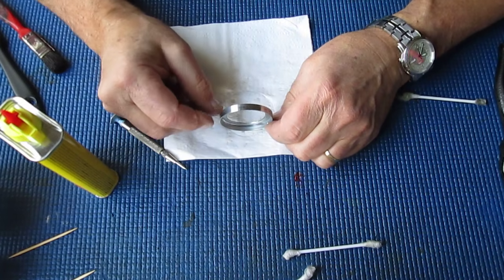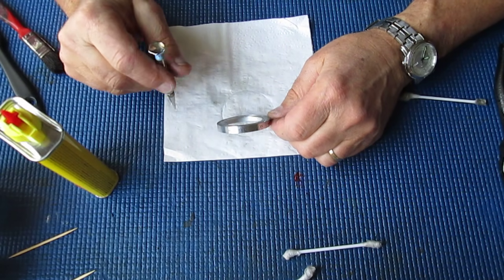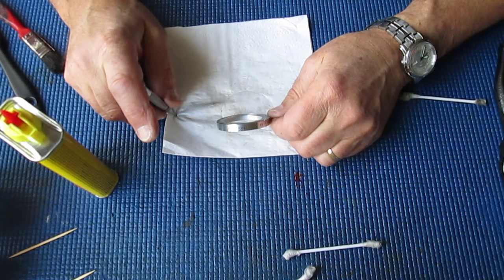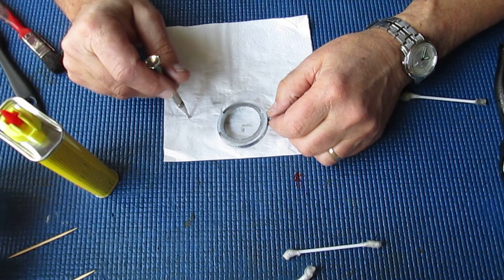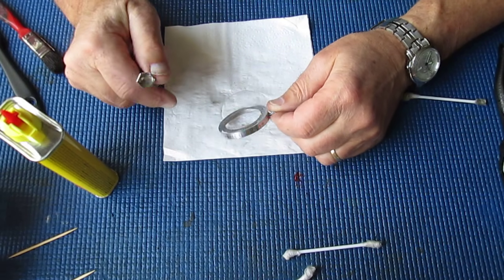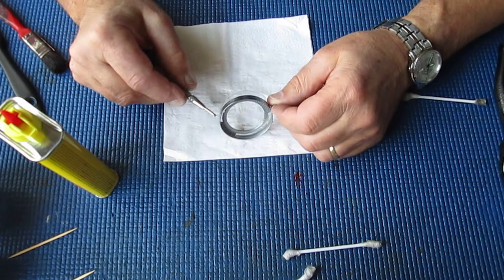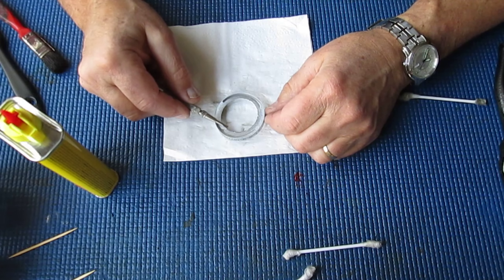Now with the type 010, the chroming was often, particularly the early ones, not up to much at all. I think from looking at them that basically they'd chromed them straight over the steel. Good chroming, ideally, they have 3 coats. They put a copper base coat, a nickel coat over the top, and then the chrome on top of that. Typically I think these ones they've skipped, there's no copper. I think they probably even skipped the nickel, and the chrome went straight onto the steel, or brass in this case. And often, for one reason or another, it's let go.